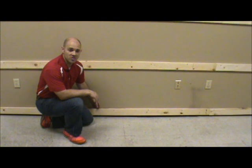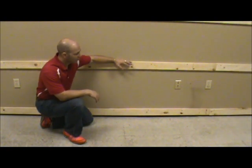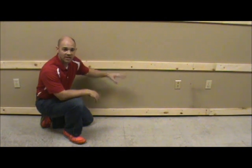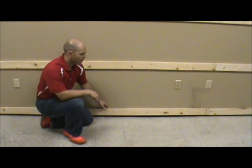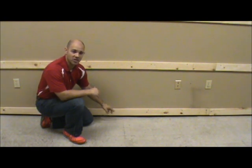The first step in putting together your fitting rooms is getting all the furring strips up. We've got all the furring strips up — make sure you check your drawing to find the correct heights. For the bottom furring strip, especially for multiple fitting rooms, find the highest spot on the floor because not all floors are level. Find that spot and measure up one inch — that should be the bottom of the first furring strip.